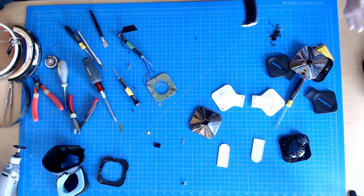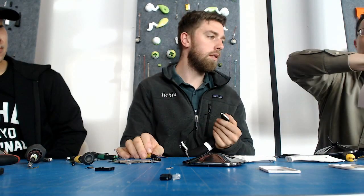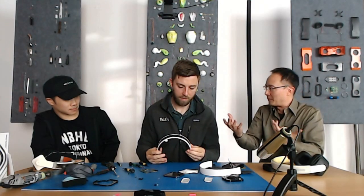You can place the old headband on an arched fixture, and there's a grip that presses down on the headband evenly, because you need every hook to engage, and you go click. And it slides it this way. So you actually had to build that fixture just to do it. Right, because otherwise you have to push every single one in, and when you're sliding it, some of them may pop out. That's awesome. So tell me a little bit what we're looking at here.